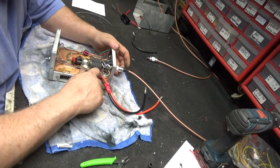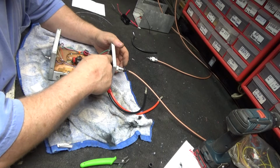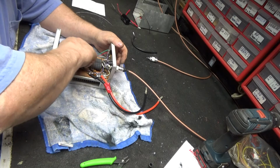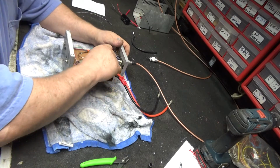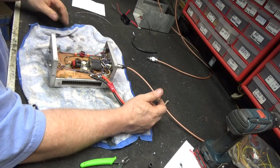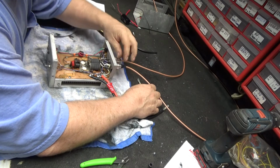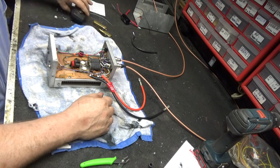Let's see, on and off switch, got power to there, it goes over there, goes to the switch, is going to come on, sends power through here back to the relay, which is over there, for the remote. The input comes in, comes through here, goes through there, goes over here, 330, 1000, two routes, back to the relay, out to the amp. Talk through is going to look perfect, I guarantee you. Audio, audio, audio. Yep. Talk through is perfect.